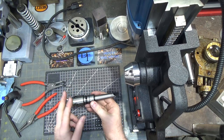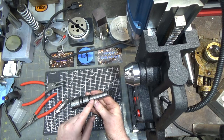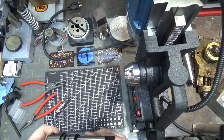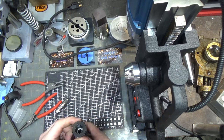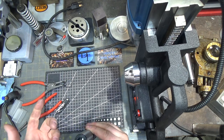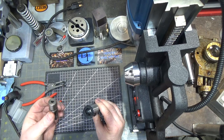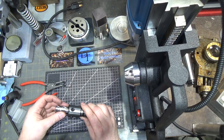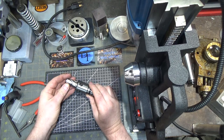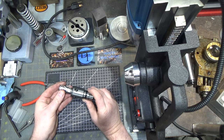I'm thinking I might replace this whole assembly with a slightly better one and see if I can improve the runout. First, I'm going to try reseating this Morse taper — it's ground but pretty coarsely. There's also this horrible lip relief inside the bore — that was actually an extra machining operation, so maybe it's to allow fluid around the outside, but I don't see the advantage since the cutters lock in tight and don't allow fluid around the outside. The cutter does not reach the allen screw inside, so I'm really not sure what that cap screw is all about.